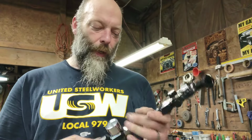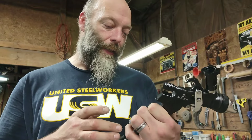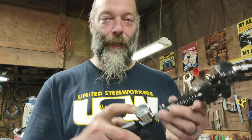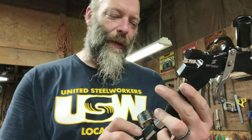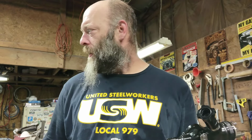The gauge seemed to work pretty good, this little regulator, it came with it as well, all in a kind of a unit. I dialed down to about 30-something pounds, 30 pounds-ish. I'm not sure if that's what it's supposed to be at, but it was in the green right there. Put it right at the bottom of the green, and it seemed to spray okay. I probably could have gone a little bit higher on the pressure, but it seemed to do okay.